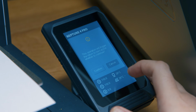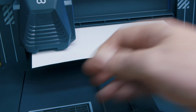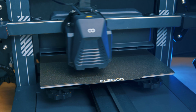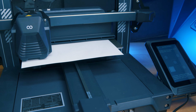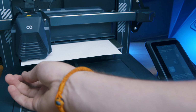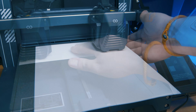When it comes to leveling printers like this, these are semi-automatic, so you do need to turn the large cogs under each corner for part of the process, then use automatic compensation for the rest. But the way they tell you to do it in the guide is not the best approach in my opinion. The printer's shipped with all of these cogs tightened to the one extreme, either super loose or super tight, so make sure you loosen each one about halfway so it's sat halfway between loose and tight.